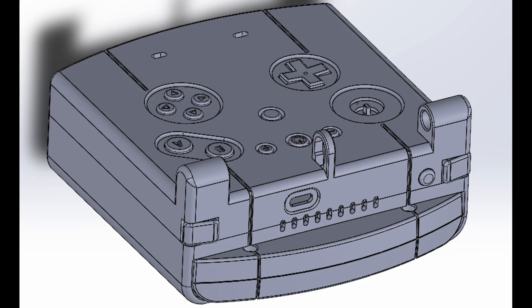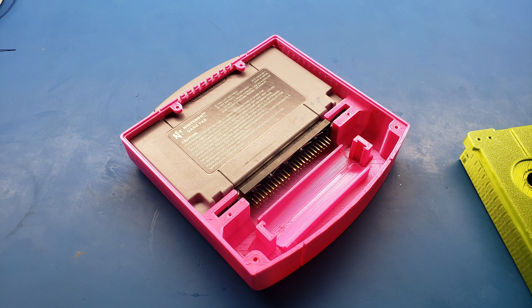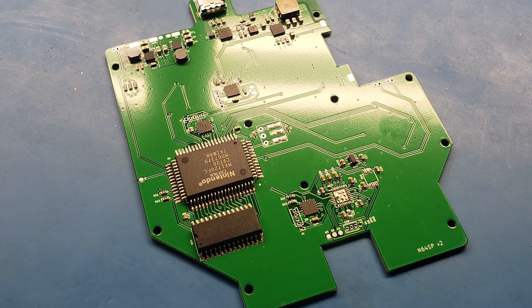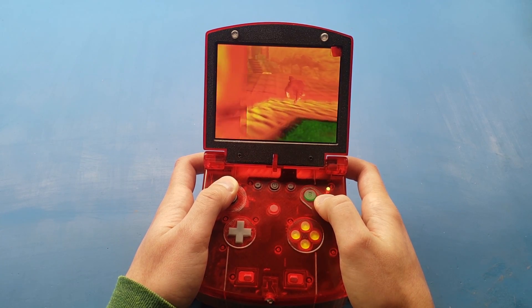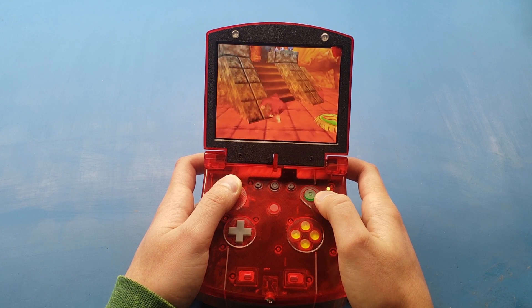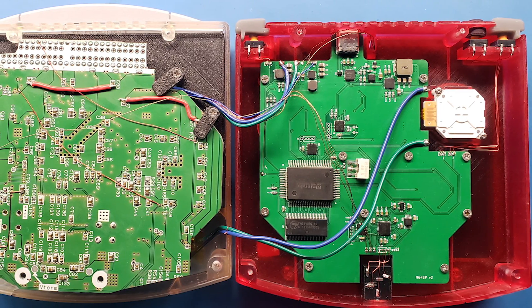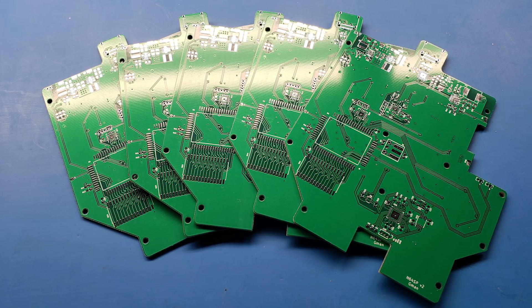For this second iteration, I made numerous mechanical improvements for streamlining the assembly, like the pop-in friction fit cartridge connector, and also room for a better heatsink on the N64. I made a new PCB which combines the battery charging, system regulators, controller, and audio amplifier. I was able to squeeze all the circuits on a single 2-layer PCB, which I got from JLCPCB for just $2 for 5 2-layer PCBs. This PCB really cuts down on the extra wires needed for finishing the portable. I'd also like to thank them for sponsoring this video.